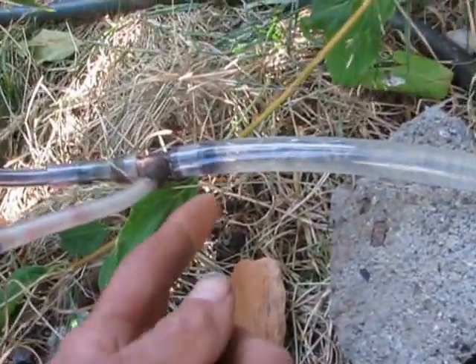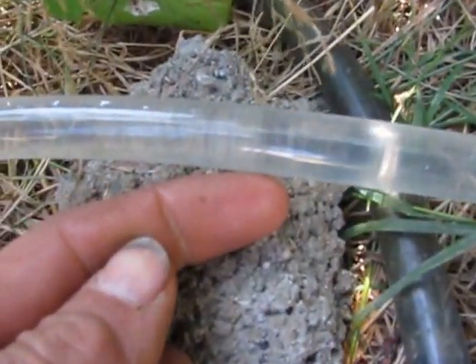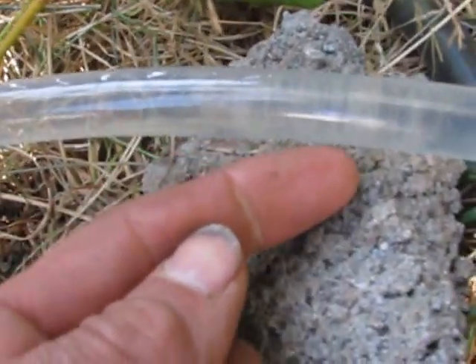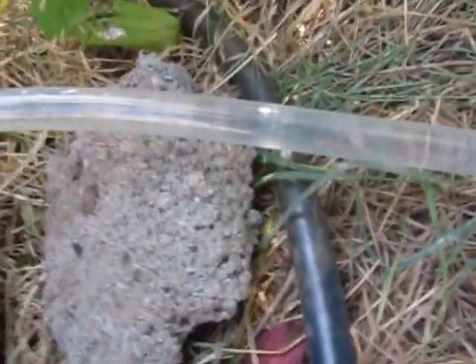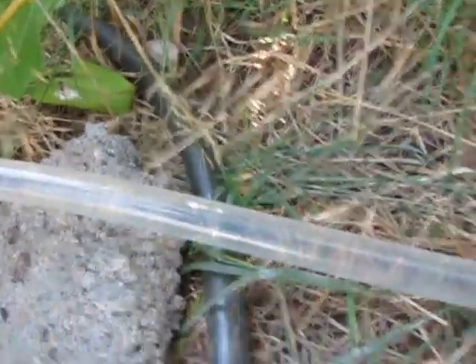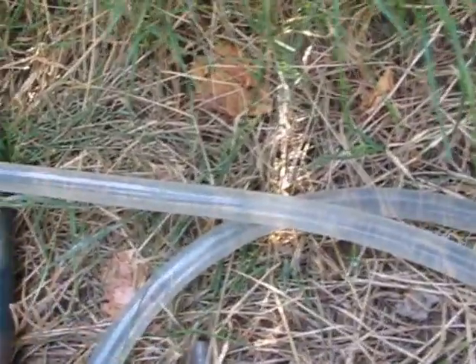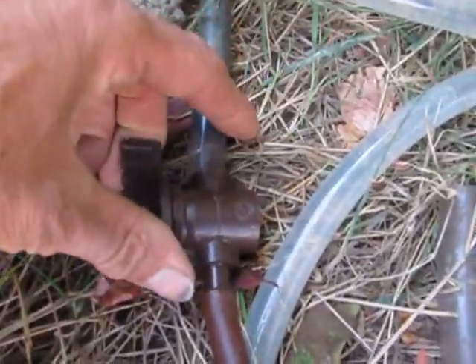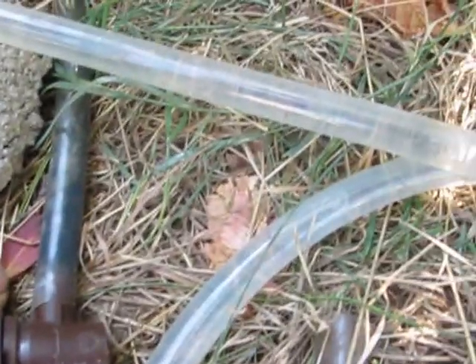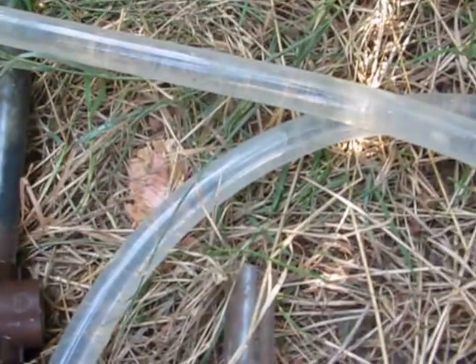You can probably see in here the little pieces of black moving back and forth. This is wasting energy because this entire loop of water, which extends further, is being shunted forward and stopped. There'll be friction and all sorts of stuff. What I do in my pumps is put in a constriction, and what the constriction does is prevent this to-and-fro movement.